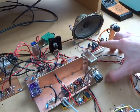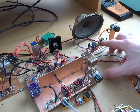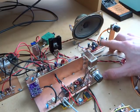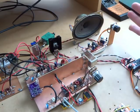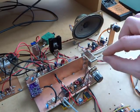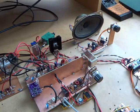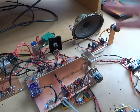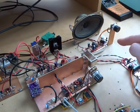I could have put in a 100 nanofarad capacitor, which works perfectly fine, but in the end I opted for a 3.3 microfarad, with the assumption that the higher capacitance means less losses in terms of capacitive reactance. And as you can see now, switching transmit and receive, that delay is fine. So that was one thing, and I've updated the schematic on the blog.